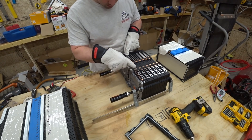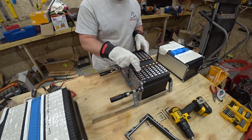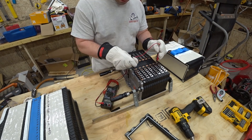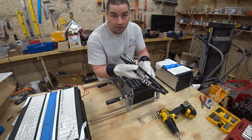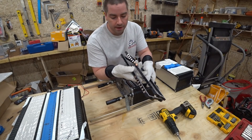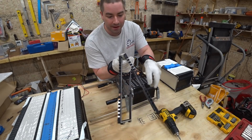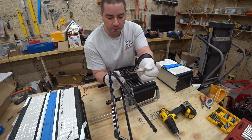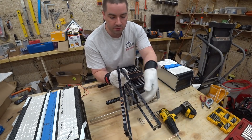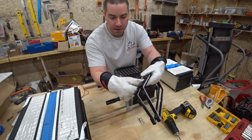I think these are probably touching each other even though I haven't soldered them yet. 48.9 volts. I have two plastic rings left that are both messed up from my angle grinding experience. So I'm going to pull these bus bars off and these plastic rings will just be spacers.